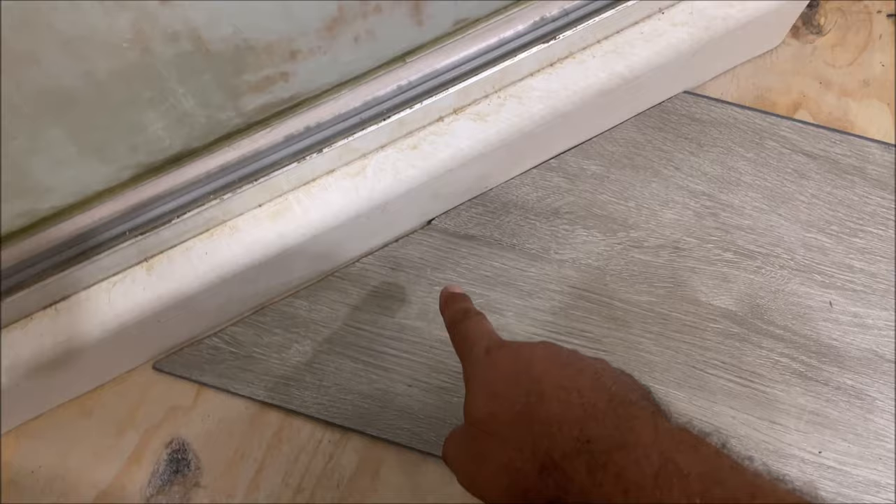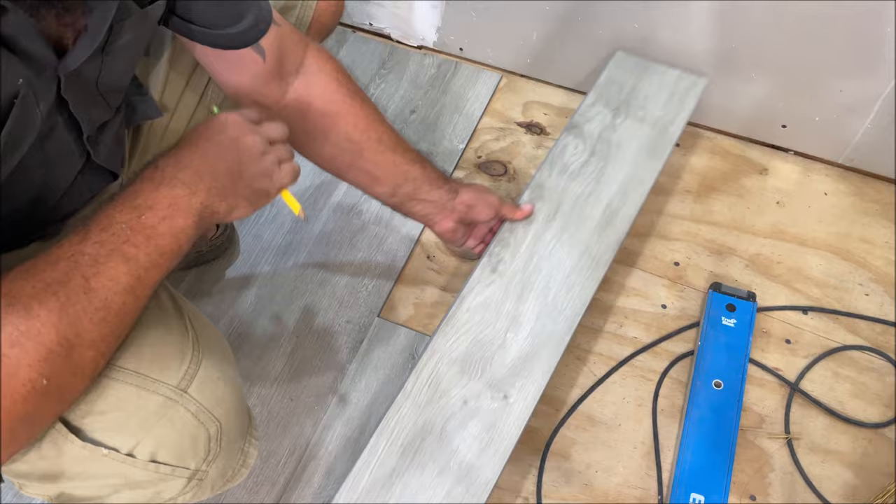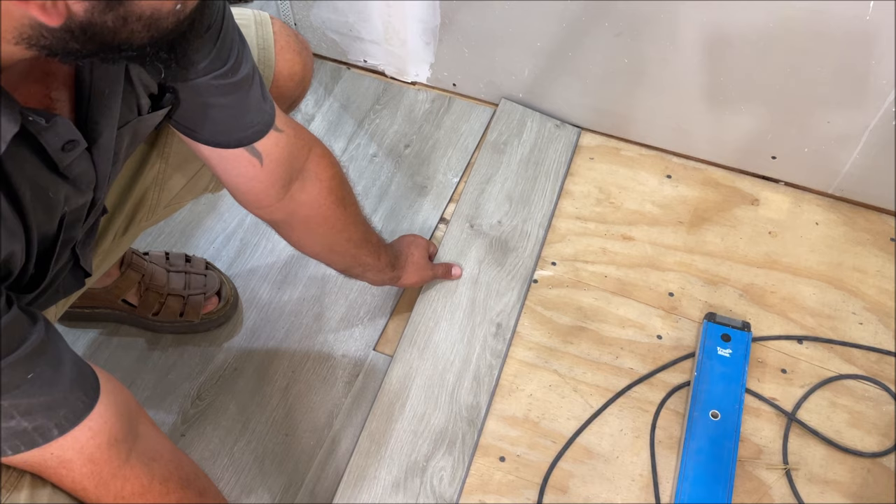In case this is the only video you're watching, let's do the flip trick to score and get the measurement on this piece — it sticks in there like that, then flip it around. Do not ever butt it up against the wall — give it about a quarter inch. Mark it. To score the piece, use a speed square right on the mark. You're not trying to force it down — that can be dangerous. Do a lot of little scratches and progressively push down as it cuts into the flooring, and it just snaps.